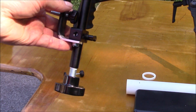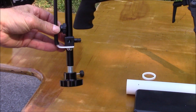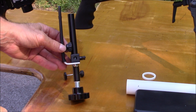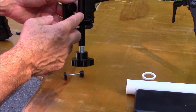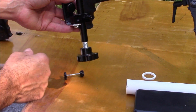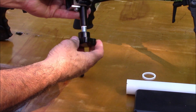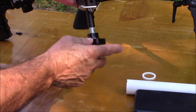What I did is I took a piece of aluminum flat bar — three quarters by eight — bent it, created my angle, and this piece here has already been pre-tapped for quarter-twenty. Now of course all these parts are metric, so this knob is a 12 millimeter knob, so I had to buy a knob for that.